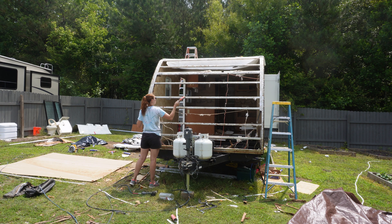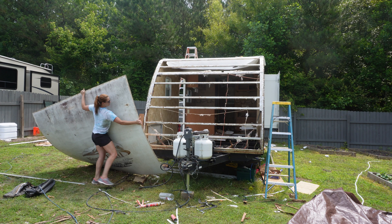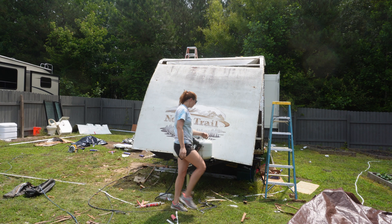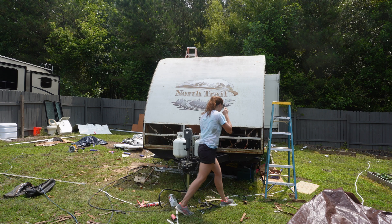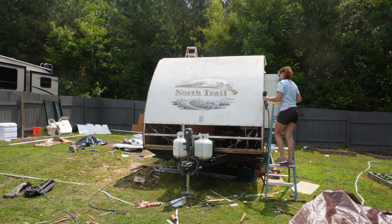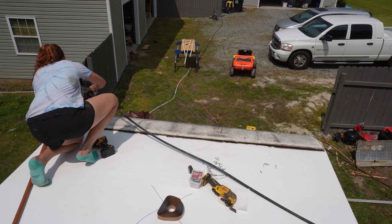I put some more construction adhesive on because it had sloshed everywhere after moving it up and then back down. Then same thing — I pick up the whole thing. I don't know why it seems less heavy this time; I was probably just expecting it. I put one corner up, pushed it up from that side, then lifted from the middle. I had my 16 gauge nailer with one-inch nails ready and just popped it in. Oh, forgot — I had to take the old nails off first, so don't forget to do that. I'm 100% glad I took it back off to make those relief cuts, because it really would have broken. And because I put those relief cuts in, I could just nail it directly down.